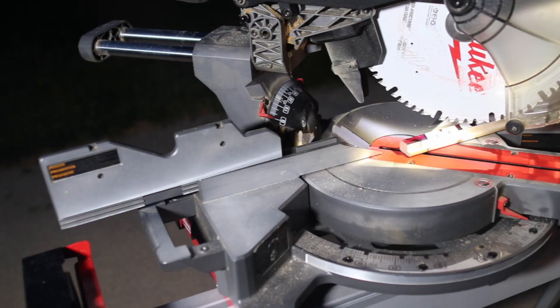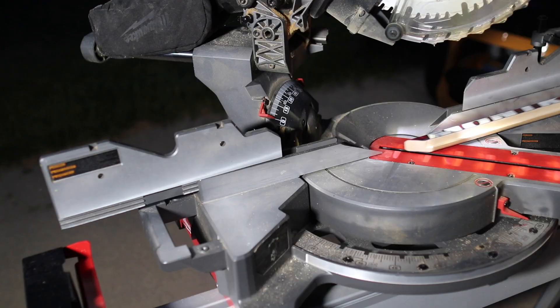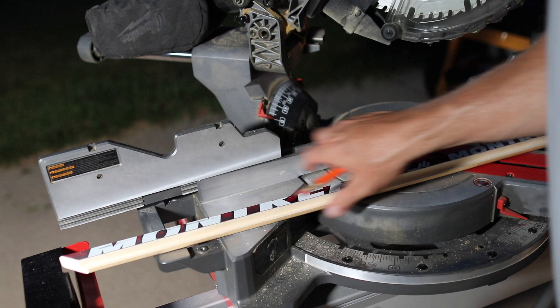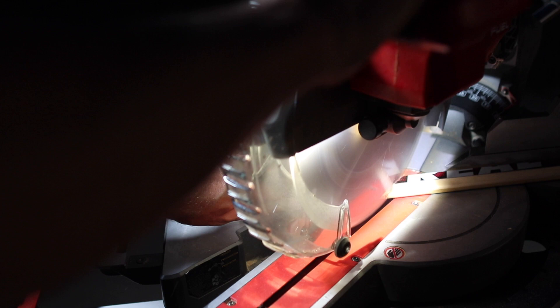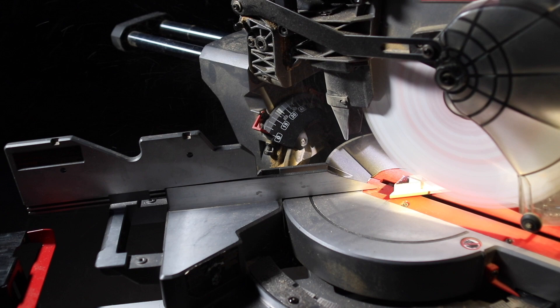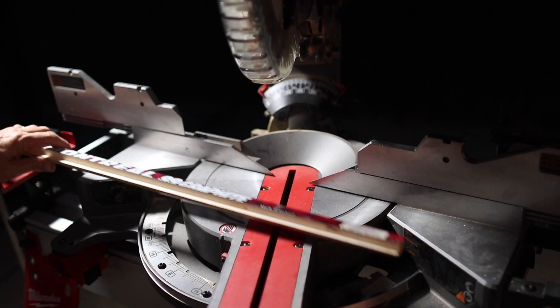I went a little deeper than I wanted to, but I think it's gonna look good. We're going to get the miter saw and cut this real quick. It's eight by ten so I'm going to cut from the inside. What I really love about this saw is it has a shadow light so I can cut right on the line. We'll be cutting at 45 degrees — we're losing part of the word Montreal but that's the way it's going to work. This is gonna be 10 inches. We'll barely have enough to work with so you can't screw up any of the cuts.